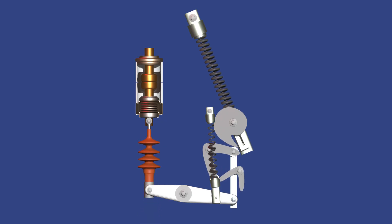During the expansion of the closing spring, the opening spring is deformed — meaning it is forcefully expanded. In other words, the stored potential energy of the closing spring is partly used for closing operations. The rest of the potential energy of the closing spring is used to expand the opening spring. This opening spring is sometimes called a trip spring. As the spring is discharged during the closing operation, after completion of the closing operation, the spring begins to recharge. Remember, the charging of this closing spring does not have any relation with the tripping or opening operation of the breaker.